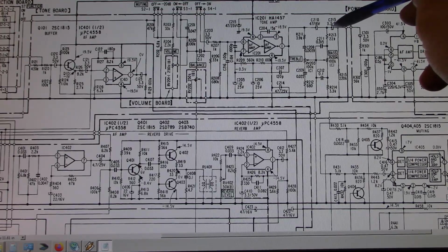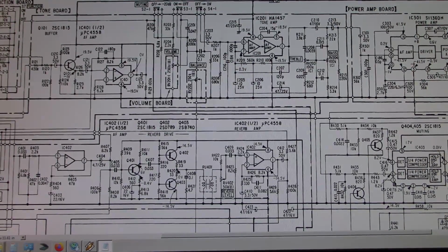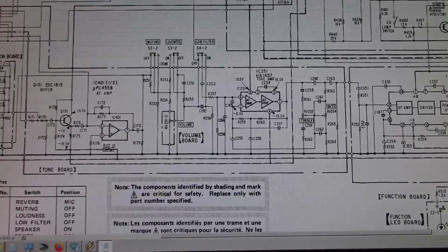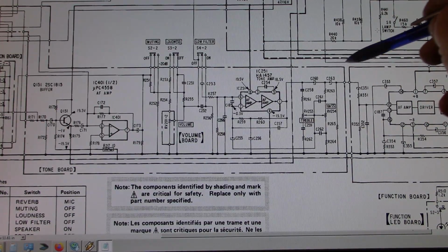So that one was open circuit, I believe. It was 2 or 3 kilo ohms ESR, and the capacitance was down in the 100-200 nanofarad range. So I changed that one out, and what I did is I changed its complement out in the other channel, which is down here. If I scroll down, I replaced C263 just so both those caps are equal.